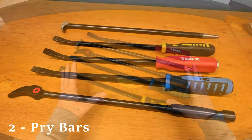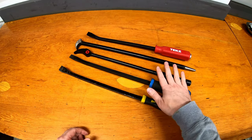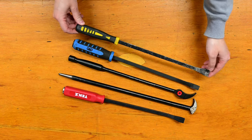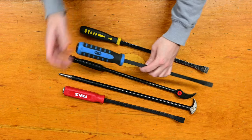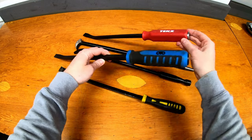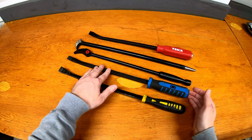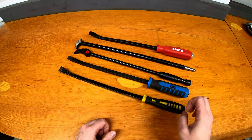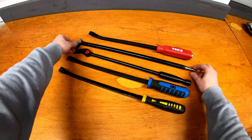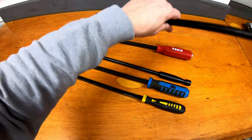Second item here is pry bars. These are all kind of the same length but they do come in a lot of different lengths — great for obviously prying on things. This is just your standard pry bar. These two in particular come as striking pry bars — you can see a metal cap on the back that goes through the entire handle and you're able to hit that with a hammer, so you can drive the pry bar into things you wouldn't otherwise be able to get the tip into. There's also the heel type pry bar, which just changes your angle of how you can pry at items.